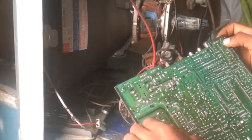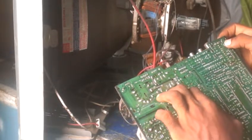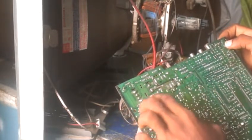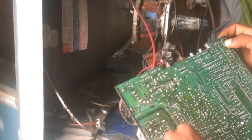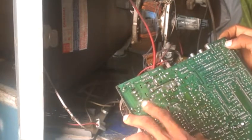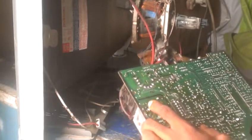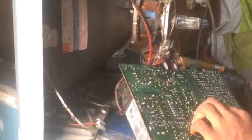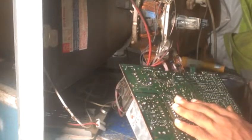Now I don't know if actually all the voltages are coming to the secondary side of the board from the primary to the secondary, because I just troubleshot the primary, where I removed the small signal transistor, which is the one causing voltages not to supply. So for us to troubleshoot it, we just have to use a multimeter, or the analog meter, to understand what is wrong in the circuit.